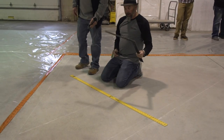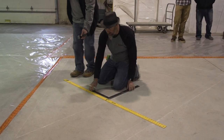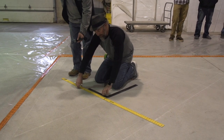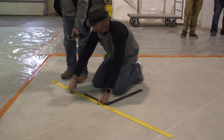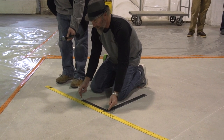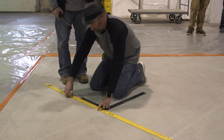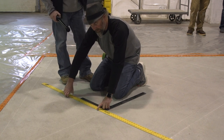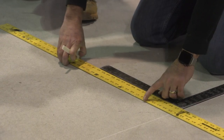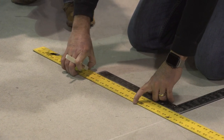So I'll take my square and line it up on the floor on a chalk line I already have, and then I can take this straight edge and I have more accuracy than just using a tape measure — trying to look at the tape measure and figure out how you're parallel with the square. Instead you just put these two together and you can measure whatever you need to. I like how you can slide it on there too. See how he's sliding it against the two-foot square — I think that's really cool.